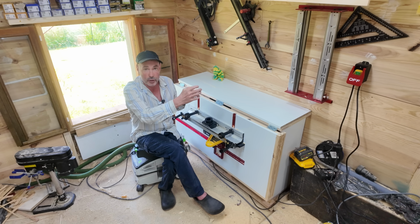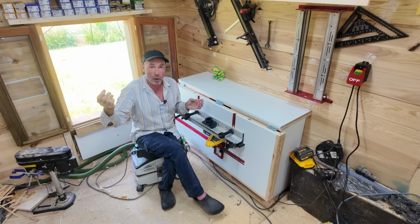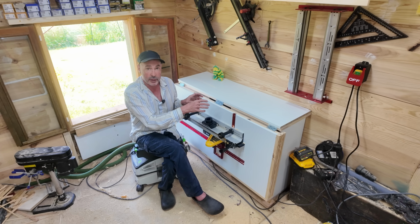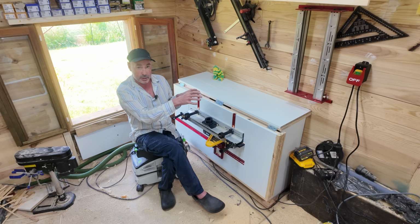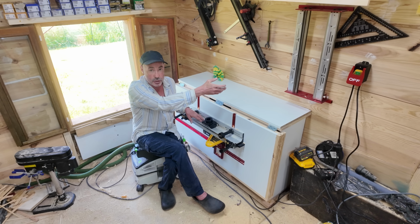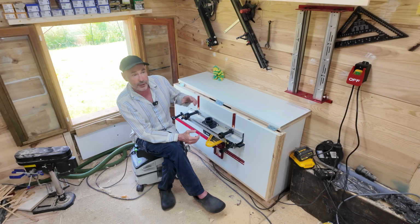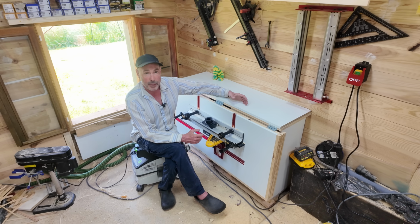We've got the nosings around the router table top with the two grooves in, one for track saw clamps and the other one for standard T-bolts, which means I can start to bolt things to the bench top. So it's now not just a router table, it starts to become this multifunctional workbench. And we've put the electric stop in as well, so we've got some safety features on this table. In the next video, I'm going to concentrate on this top and mounting some of the other accessories I have.